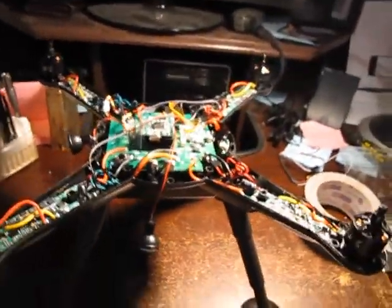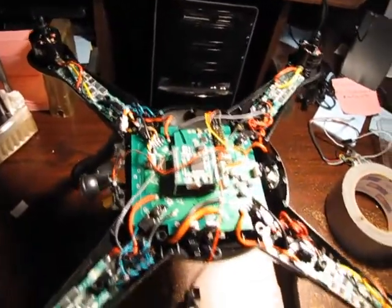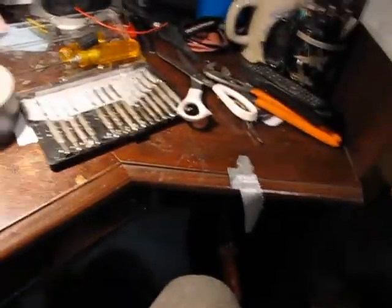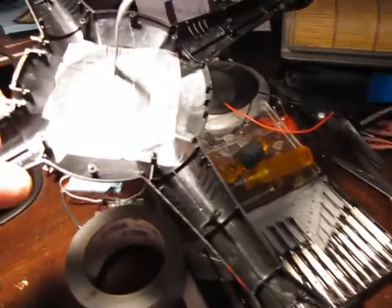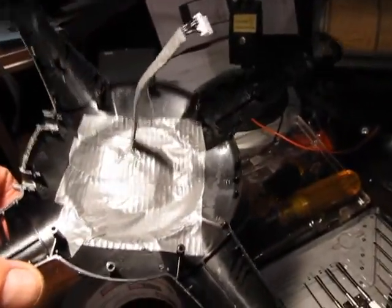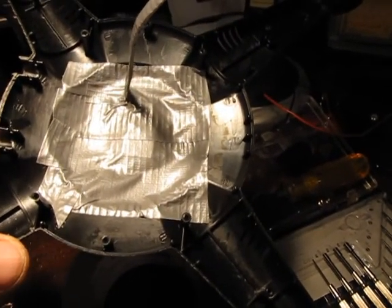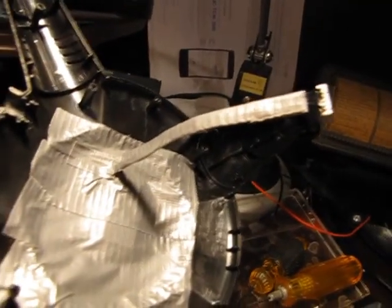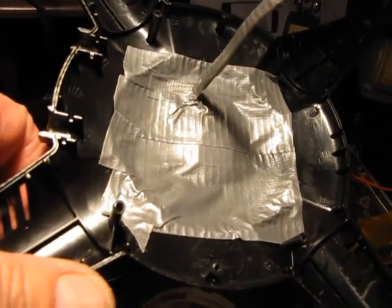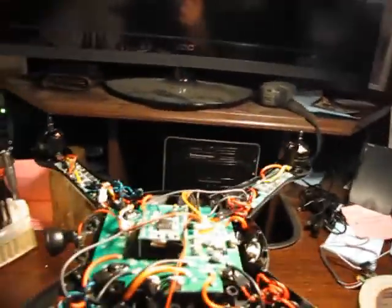Here we are, we got the 380 taken apart. There's how it looks on the inside. I've got the lid over here and I completed the isolation of the GPS. Put two layers of copper tape under that duct tape, put two layers of copper tape on that wires coming out, and then I covered it all with duct tape to isolate it from the rest of the board in case something hits. They call that the GPS mod.